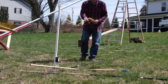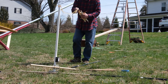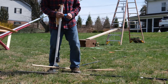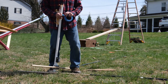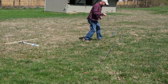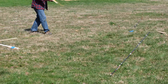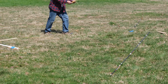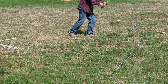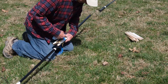Now it's time to wind up all the ropes and wires. First I wind up the strings that support the cross beams and tape those strings onto the PVC mast. Then I pull each wire element to the side of the cross beam to wind them up together. I like to wind up the wires and strings from the outside in toward the cross beam because it's so much easier to unwind that way, and then we can tape the wire wind-up boards to the cross beam for storage.